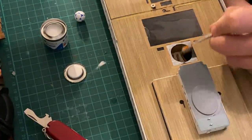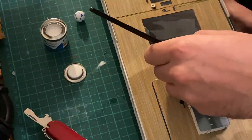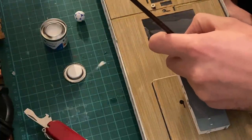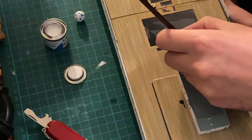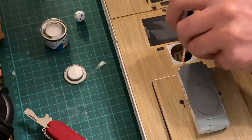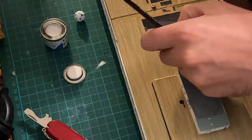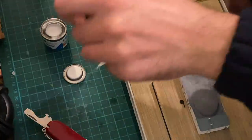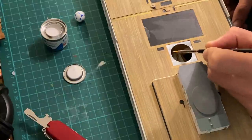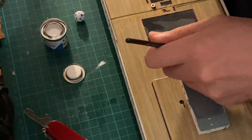Now, the reason I did that is I wasn't entirely sure if it was necessary, and I suspect probably wasn't necessary, but brass does what's called work hardening. So it's pretty much what it says on the tin, really. As you manipulate the metal, it hardens. So essentially, as you manipulate the metal, you're undoing the annealing process. And because the metal's getting harder as you work it, the likelihood of you snapping the spindles of the dome increases. So that's why I annealed it halfway through, just to undo that work hardening and to make sure it was nice and soft again. But as I say, I just want to make clear that despite the video being relatively quick, this was not a quick process.